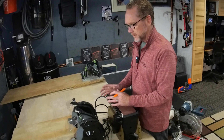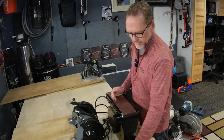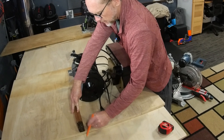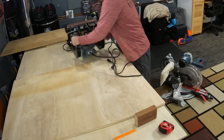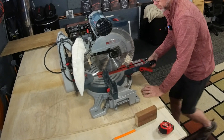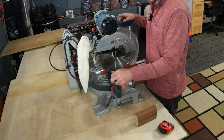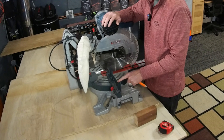When you're measuring up your flip top cart, get your largest single tool or your combination of two tools, put them on the flip top, measure out the two by four on the edge, make sure there's good enough clearance for your tools, and create that square. Then take your other tool and see if it fits inside the same square. I'm going to put my chop saw on top now — looks like it'll work fine. Be cognizant of where the mounting holes are for your power tools. We're going to put threaded bolts through the three-quarter inch plywood into a receiving sleeve on the underside, and we've already lined up the holes so it won't interfere with any other hardware.